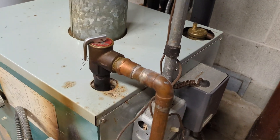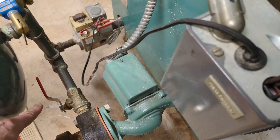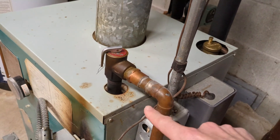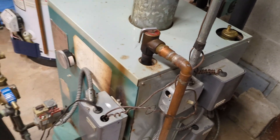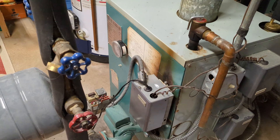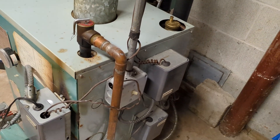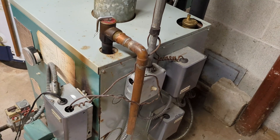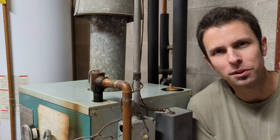After you have that new pressure relief valve installed, you want to open up the shutoff valve to let water into the system. Make sure your pressure relief valve is not leaking, and then open up your other shutoff valves for the rest of the system. Turn power back on, call for heat, and monitor the pressure relief valve for leaks. Thanks for watching — any questions or suggestions for new videos, please put them in the comments.